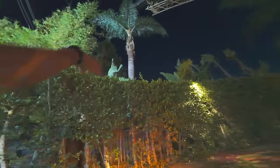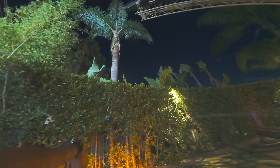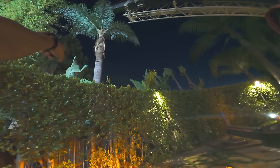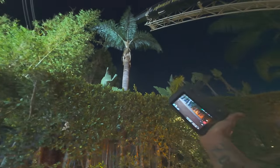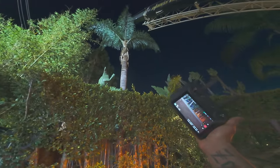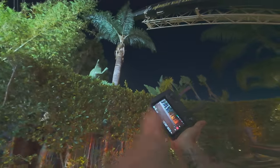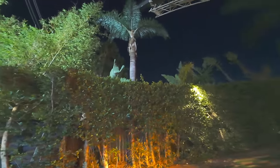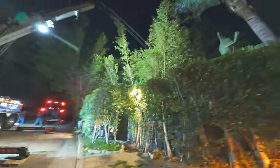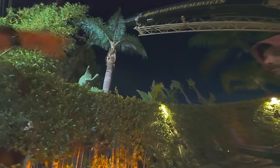So the initial thing was this, because when it hit, it kind of wedges itself against the other tree. The trees give way, right? They're not rigid all the time. True. So when it's hitting, there's pressure on it. As you're pulling up, it's sliding up, and there's shock load on it. So you have to be careful not to pull too hard, because I could winch all day, but either that thing just slams forward, and at that point I can't catch it going this way, or the truck starts coming over.